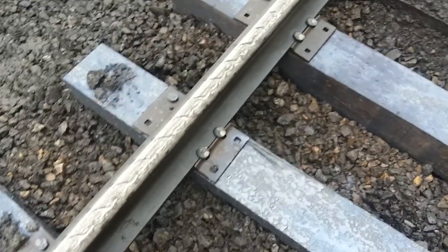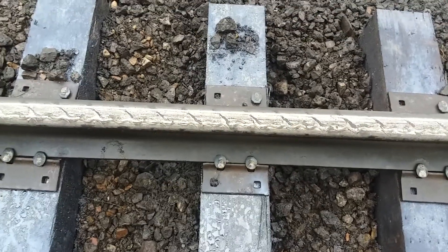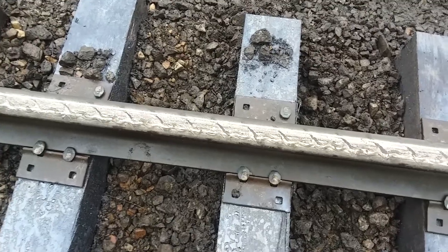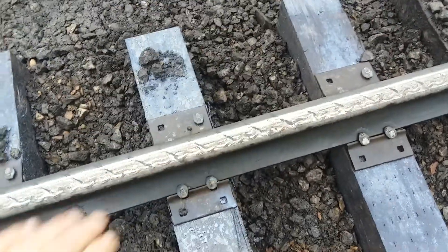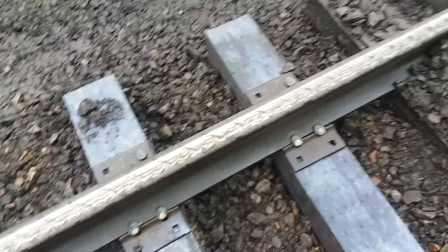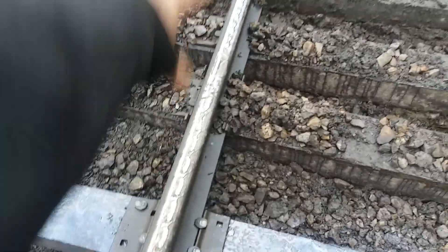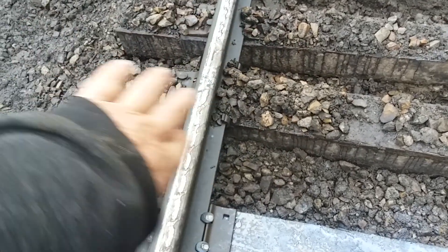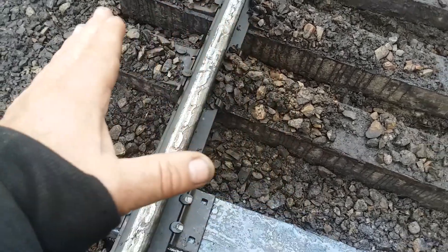Here's something else I want to tell you about the tie plates — a lot of people don't know this. Tie plates aren't cut flat; the rail is not laying in there flat. It's a 1-in-40 cant that the tie plates are cut at. I don't have a tie plate here to show you, but the rail is leaning a little bit, almost 3 degrees in. Both rails are like that — all tie plates are cut like that. That helps when the train's coming down through here; it helps prevent the forces from pushing the rail over. If the rail was laying in there flat, it would have a much greater tendency to want to roll that rail over, especially on the high rail on these curves.